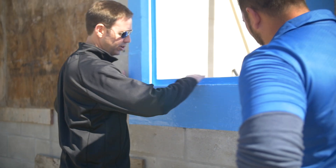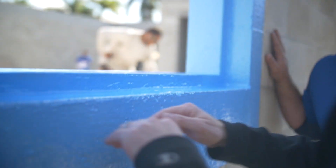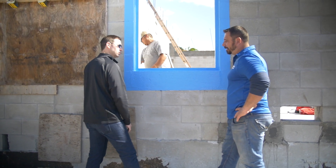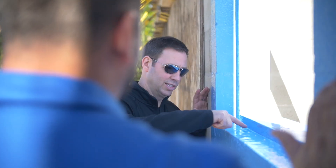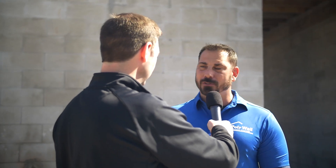So there's no lath in there basically? Correct — although you can lath it because it is self-healing, but on this home we'll go scratch, brown, and then finish coat. What did builders do 10–20 years ago here in Florida? This is a big sponge of a house, it rains all the time. We actually drove timber piles 30 years ago and used a lot of regular conventional framed lumber. I've taken part in either tearing those apart and fixing them or knocking them down. What they used to do — ship-lapping paper, felt paper, nailing it in — moisture finds its way in and rots that wood out. So on the exterior skeleton it's primarily concrete, and if there is any timber we go over it with a fully embedded fluid-applied system, because moisture will just get behind that paper and tape.